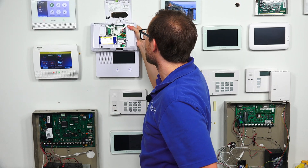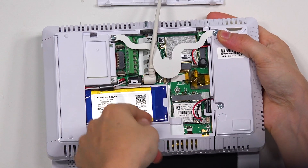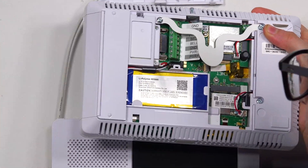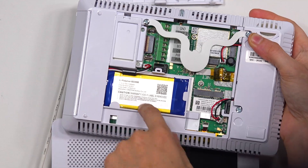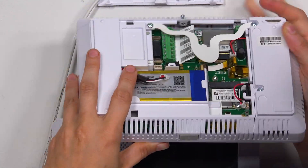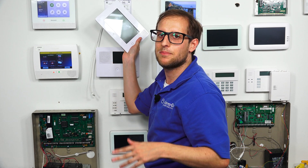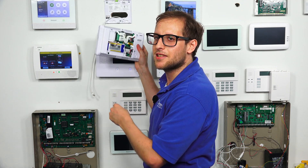So we got it off the wall here, and you see we have AC power coming in from this Honeywell LT cable here. And we can just go and disconnect that. So unplug that. We're going to also cut battery power by undoing the battery connection here. And then we're going to see that the system is completely powered down — it has no power to it, so it is not receiving power. So to complete the power cycle, we have to restore power to the system.